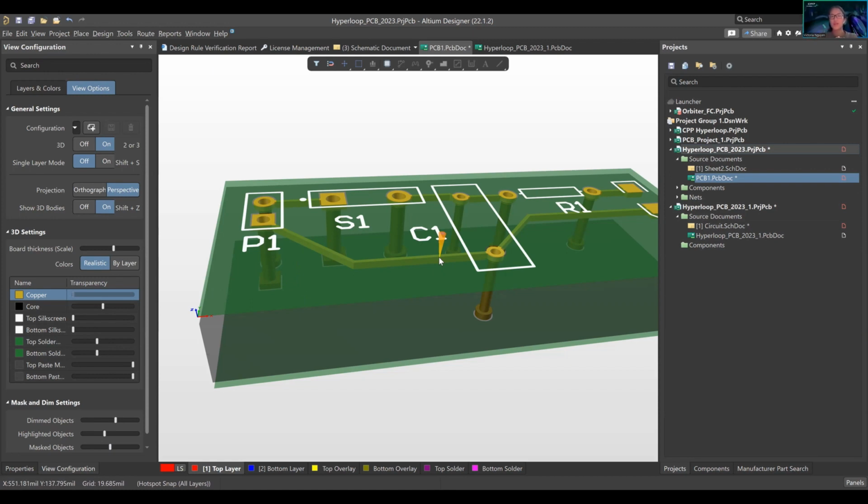And then they may go through another process, conformal coating, which is essentially full insulation. It's a little like liquid, just spritzing kind of, and then it encapsulates the entire thing as another insulator. There's a bunch of insulation that goes on here because you have so many different materials in the board, and you don't want to expose them to anything when it comes to moisture, temperature, or shock, like if it drops on the floor. So all of that is in play here. I hope that answered your question.